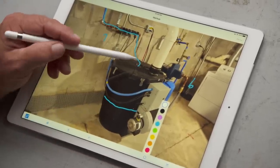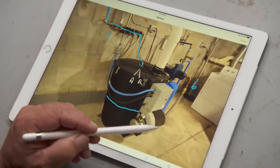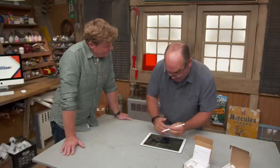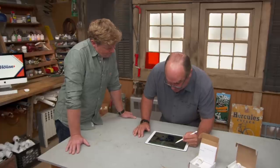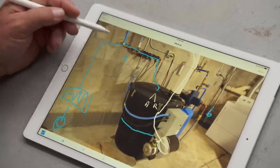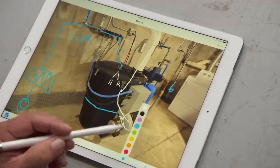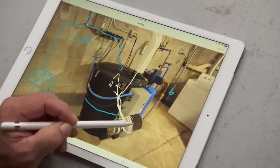Water sprays down through the nozzle carrying water, air, and radon. The blower fan pushes it through, picking up the radon and air and exhausting it above the house. In normal mode everything is in balance. But what we found is that the 7 gallons per minute didn't always exist. Coming through a restriction that could change at any time, 7 could become 6, could become 5. When the outflow of 6 gallons per minute won out, the pump would pull, the water level would drop, and the air and radon — instead of going up the vent pipe — would be pulled the wrong way, right out through the faucet.